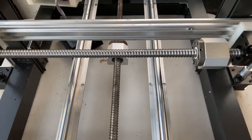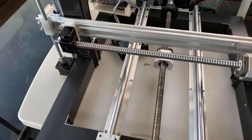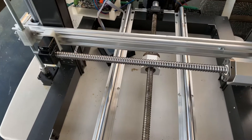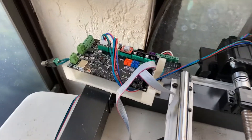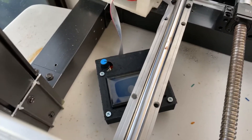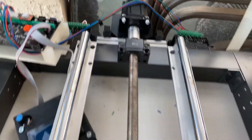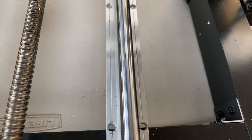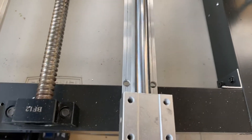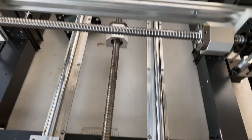I don't want to skip anything — when I print stuff I want to be able to print as close to perfect as possible. There's the board, the controller and all that. You can see I'm using a NEMA 23 with a ball screw — a 16 millimeter ball screw — and these are 16 millimeter rails, not the rods. I'm working on it, I'm definitely working on it, I want to figure this thing out.